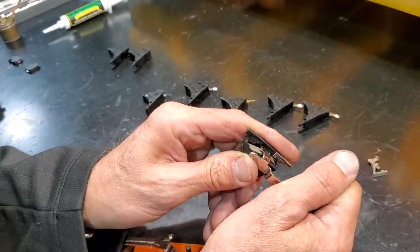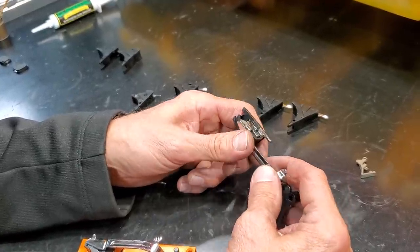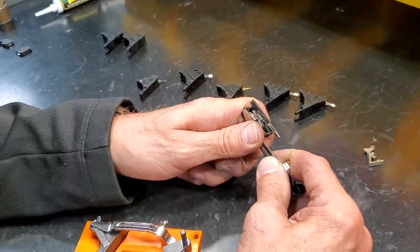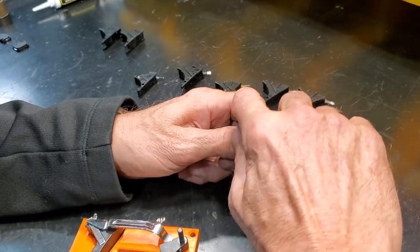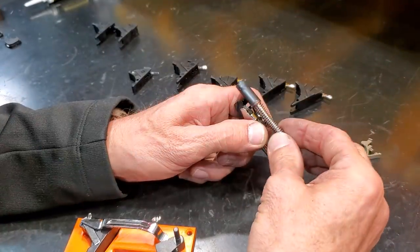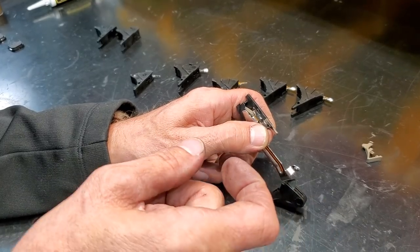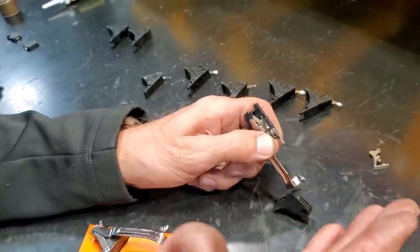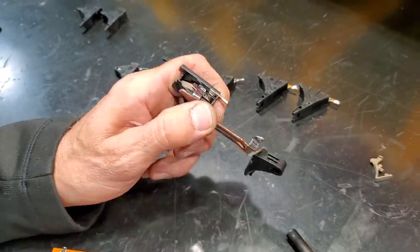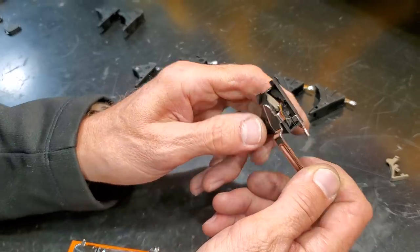With the New York spring, you have a little bit of obstruction - it's harder to pull back because you have nothing helping you. This is for the revolver shooters. When New York City police switched over to Glocks, they wanted something that mimicked a revolver, and the striker-fire weapon as it was just didn't have that characteristic. So they put this in, which means all the way forward you have all the weight of the striker pushing against the lug and against the sear - it's loading that compression spring the whole way back.